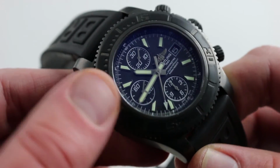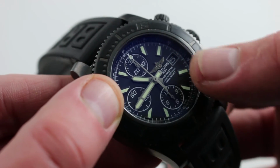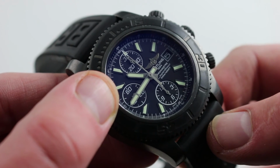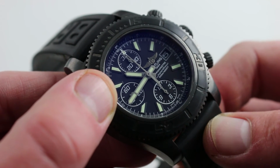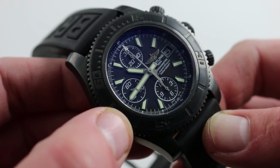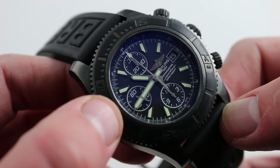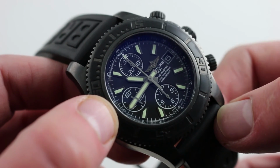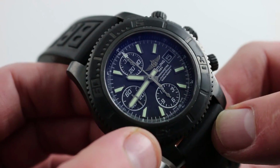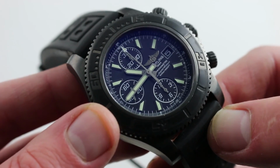It does feature the chronograph. It does feature hacking seconds, so you can pull the crown, stop the balance, precisely synchronized to a known accurate reference time, and you'll notice if you watch that the watch does have a constant seconds hand at 9 o'clock, so that's what stops for synchronization. There's a quick set for the date, such that you can rapidly cycle and correct the watch should it run down or encounter an irregular length month. And of course, the 7750 is tank tough and truly a movement in the spirit of this timepiece.